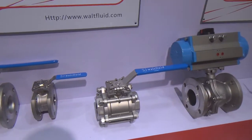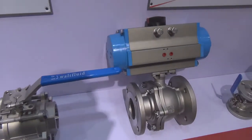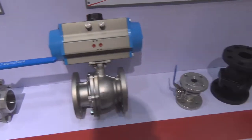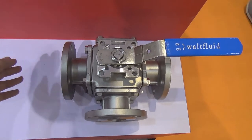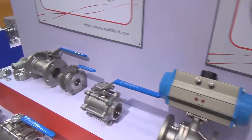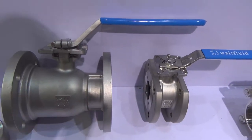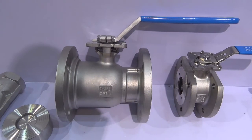Let's take a look at some ball valves. This one is a one-piece ball valve, and this one is a two-piece ball valve. And here we also have a three-way ball valve - it can control the flow medium from three ways. The one-piece ball valve is a very special kind of ball valve because the valve body doesn't have any place where the medium will leak. So this kind of ball valve body will never get a leak. Beside this big one-piece ball valve, there is another one-piece ball valve whose valve length is much shorter because it uses a different standard.